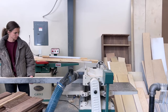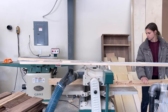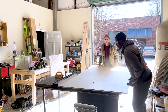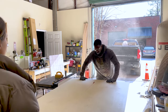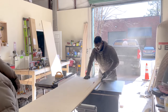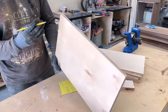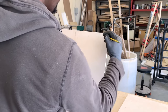I'm not actually going to make the whole carcass with the kick plate included. I'm going to create a separate kick plate out of these two-by-fours, so we're planing everything down to size before we install. We're cutting more plywood down to manageable sections to start the install process. Everything starts from a rough number then cut to final size — never cut straight from a four-by-eight sheet to your final size because if you wiggle the plywood you're stuck with whatever you just cut.